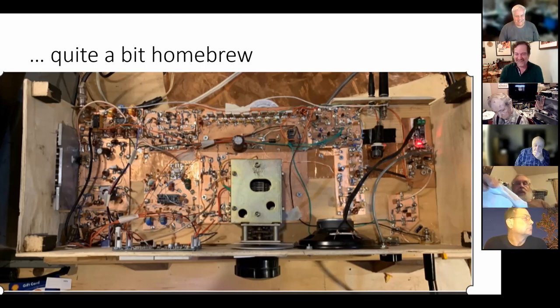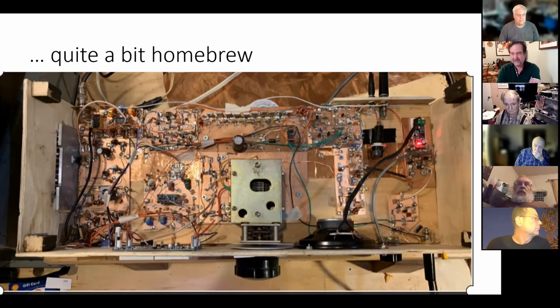That's not a problem. The other really odd thing, I haven't tried this, is if you want really good long-term stability, use a vacuum tube instead of a transistor, like a 6CW4 Nuvistor. The reason is transistor characteristics drift with temperature. Tubes do not. Well, these are other tricks. Ironically, if you leave all the heat producing active components out of the box and let them vent their heat and dissipate, things stabilize quite a bit.